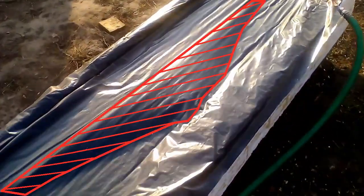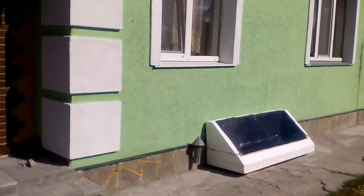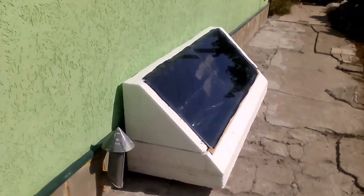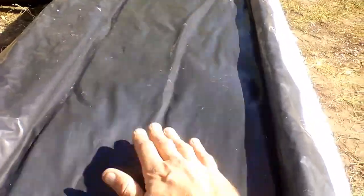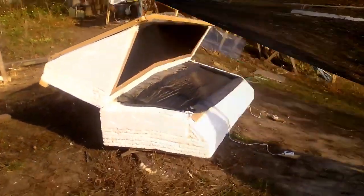In addition, the efficiency will decrease if the height of the sleeve increases. Another cause of decreasing efficiency is these air bubbles; however, we can easily remove them. This solar heater is very simple and cheap, but we must be aware of its disadvantages. For example, the low temperatures of its hot water require its use together with an electric water heater. Another disadvantage is the short lifespan of this polymer sleeve, and therefore we must periodically replace them. In addition, we must be able to easily lift the transparent cover to replace the sleeve, remove those air bubbles, and for other purposes, and now I show three possibilities to lift it.